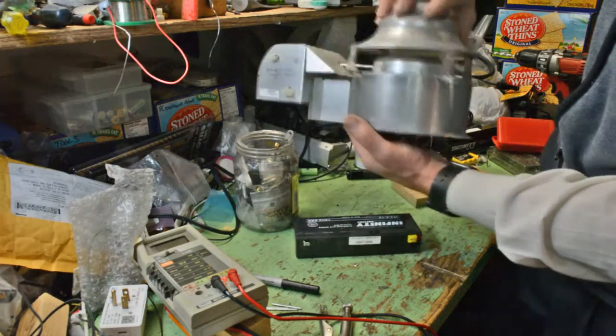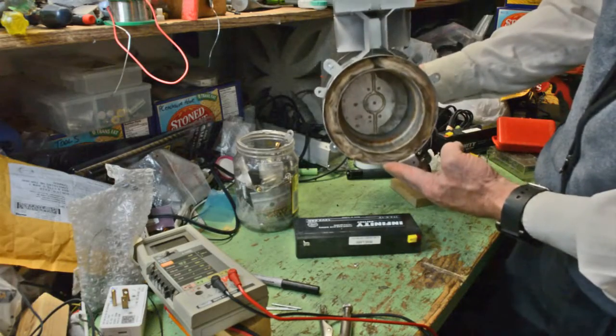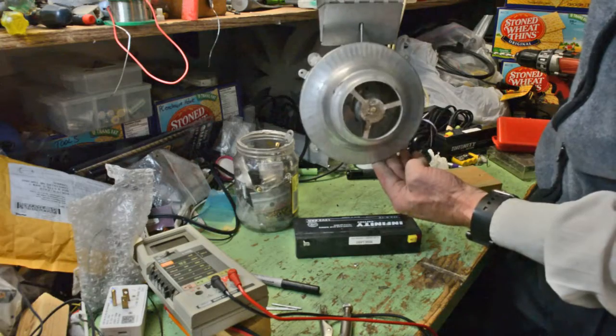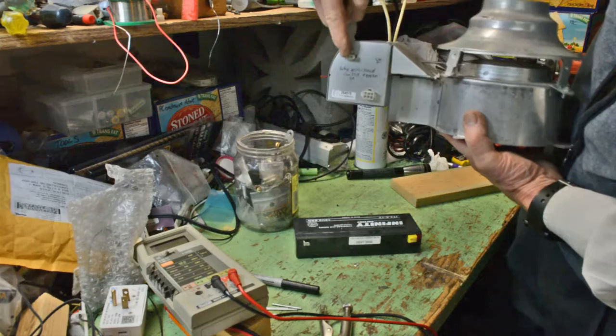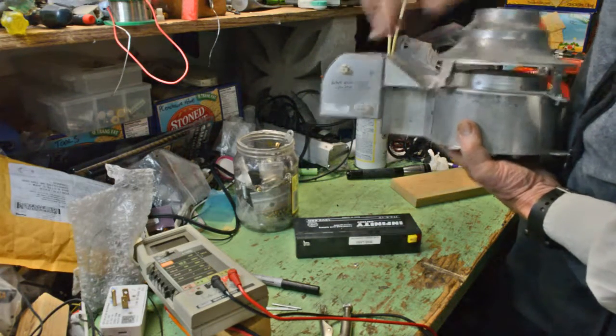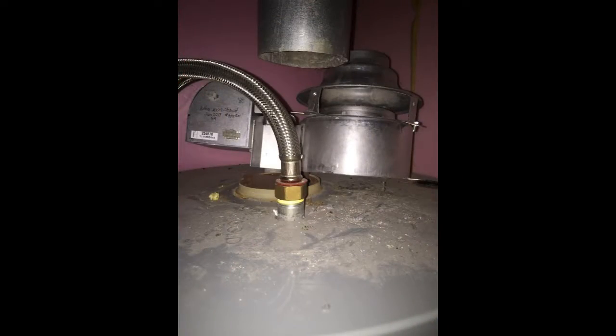One more time, the 360. Flap valve, 3 mounting tabs. They're 1/4 inch self-tapping machine screws that hold it on the top of the water heater. 24 volt AC input from the wall wart. That connector goes down to the burner assembly and the control that's on the front of the water heater. This is what it looks like when it's in place, and of course you'll put the venting assembly back on the top of the flue damper when you're done, and plug in the 2 connectors.